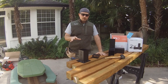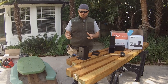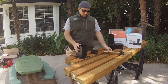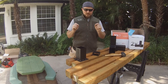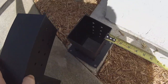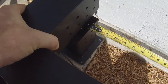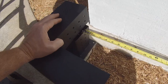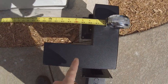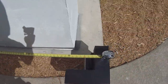The idea of this system is that if you want, you don't have to make any cuts in the wood — for a standalone kit you can just buy wood at the store and slap it together with no cuts. Ours we're going to have to make some cuts and measurements because we're doing a custom size and mounting it to the house. Also be particularly careful: if you're tapping the brackets on with a mallet, your cuts need to be really good because once you tap them on they'll be very hard to get off. The top piece coming out of the post will be an eight-foot 4x4 — you can also do this with a 6x6. We're at about 66 inches for the front piece, going from post to post. So we'll do eight feet up, 66 inches across, then figure out the length to the wall.